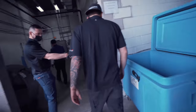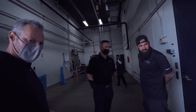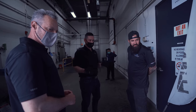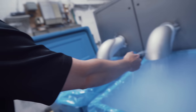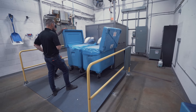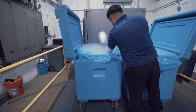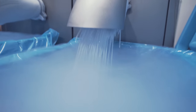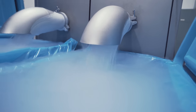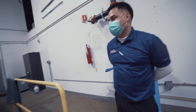These are 500 pound totes — basically you've got a week and a half worth of dry ice in there. You're losing about 4% every 24 hours. It's coming out now — it's negative 109 degrees.